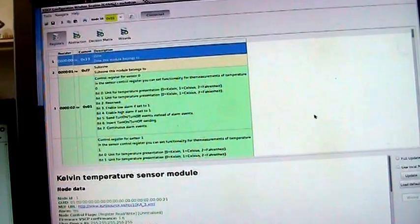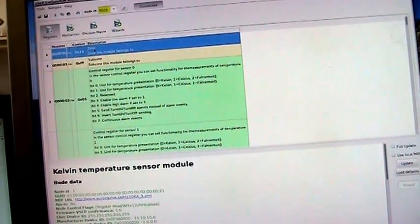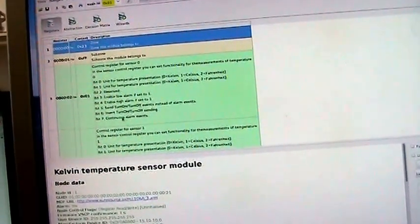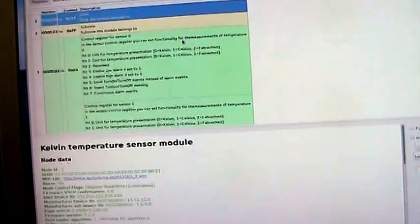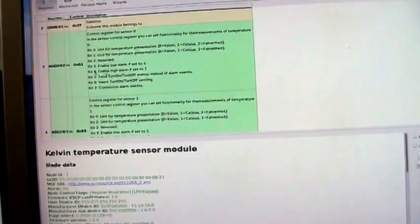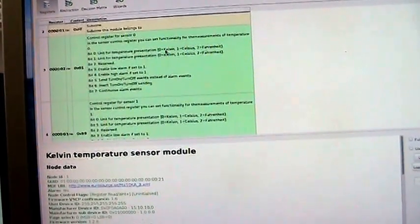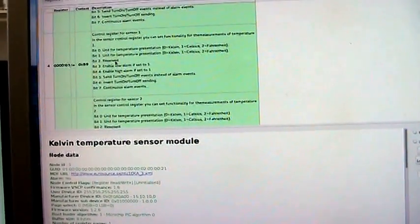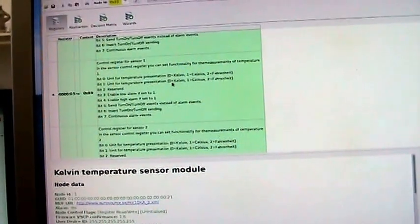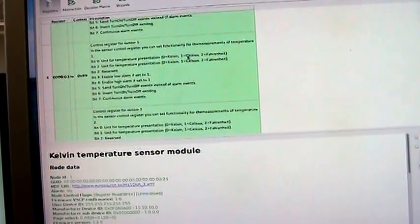So what we want here is to really have a system that is autonomous, of course, and I know now that this is the first module, so I get the configuration for it. The zone for this module is 23 hex, and we have subzones for each temperature sensor in it. We have the onboard temperature sensor here, which outputs its temperature in degrees Celsius, and we have the second temperature sensor, the first external temperature sensor here, which outputs its temperature in degrees Celsius also.